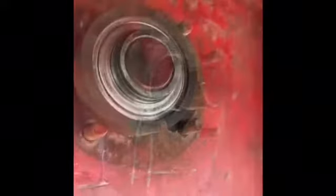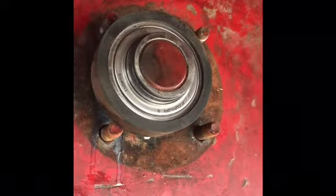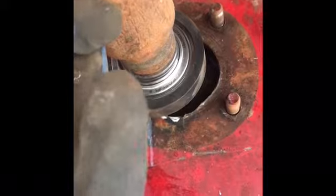Once we get there, we can even strap it up here and pull it that way with just a little strap. So we got the bearing put back on — we got it tapped on to that point, and we found an old swedge that will go right up here just like that. You just want to tap it on slow until it gets over the shaft. We got the rubber flange on the outside of it, we got under here ground off some of it, and had to take a chisel to get on the back side of that bolt to knock that burr off.